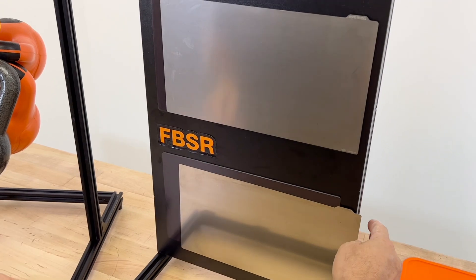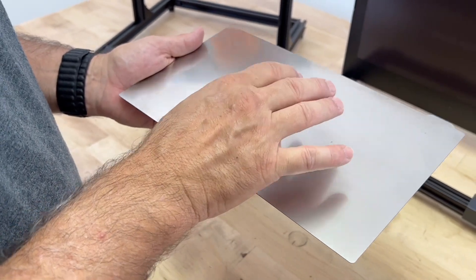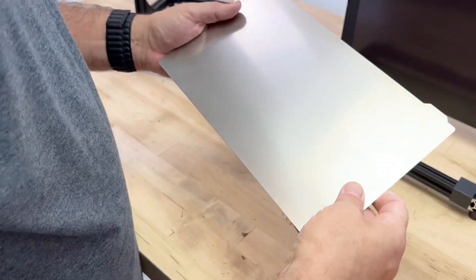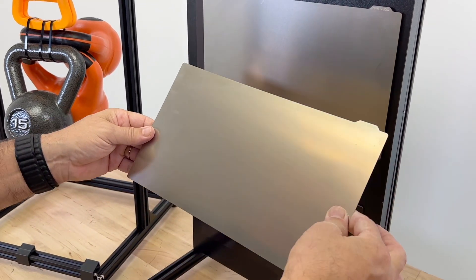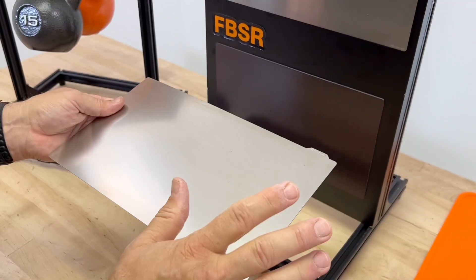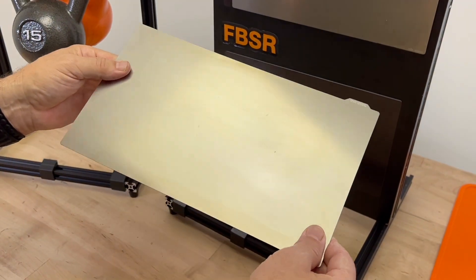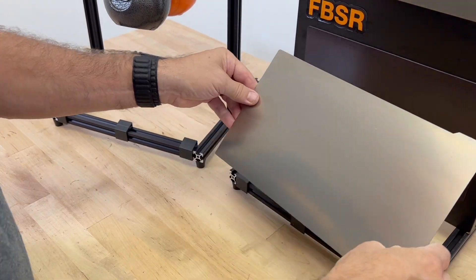For that reason, if you're more of a small print maker — you print miniatures or smaller things — you might want to go with our standard FBSR system. It flexes better, it has a lighter etched engraving, and it has just the right amount of grip. You can also mix the two systems: for example, put an XTR magnet and flexi-plate on your build plate, and when you need to, swap out for the regular 0.4mm plate for smaller parts. Just remember to change your Z equals zero setting to adjust for the 0.2mm thickness difference between the 0.4mm flexi-plate of the FBSR and the 0.6mm flexi-plate of the XTR.